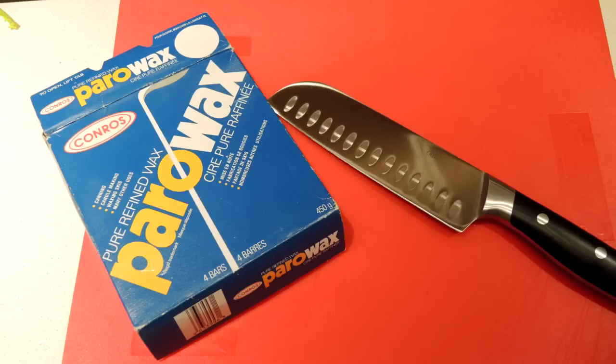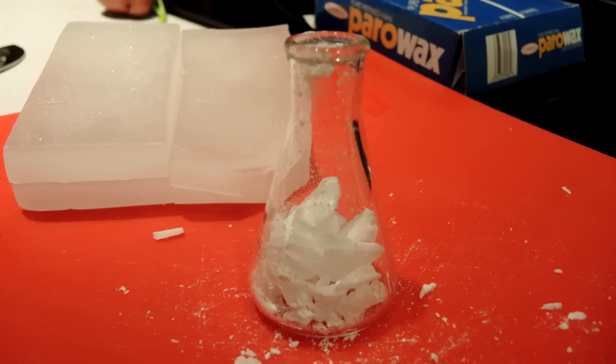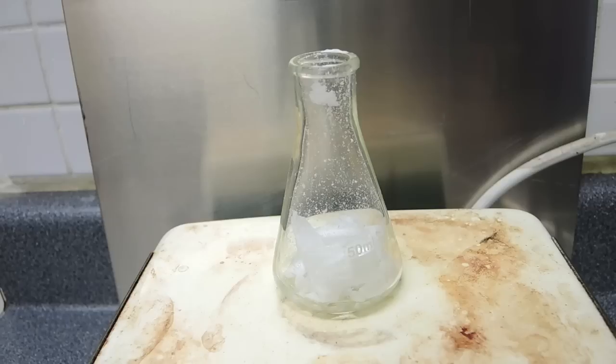So what you're looking at is some wax — paraffin in fact — it's used for sealing the tops of canning jars, maybe for home canning making jams and such. It's a substance that has a good low melting point and is easy to handle. I needed something to hold these silicon dies, which are extremely small, and I wondered if I could encapsulate them in a little bit of wax as a holder. That's what that chunk of paraffin is all about in that photo.